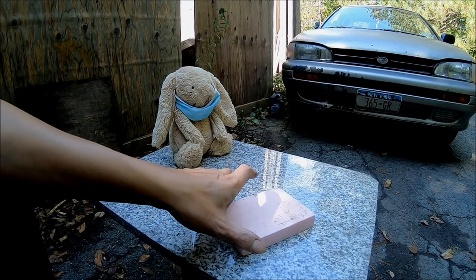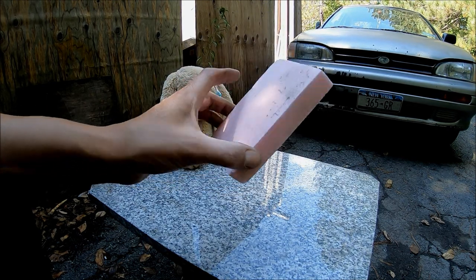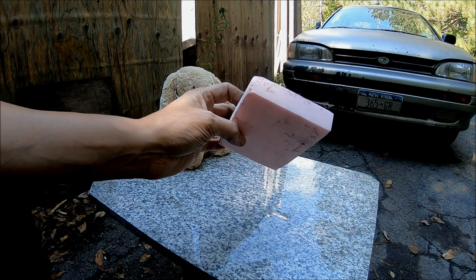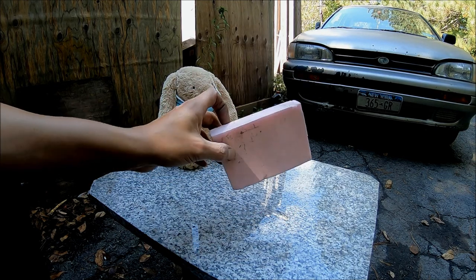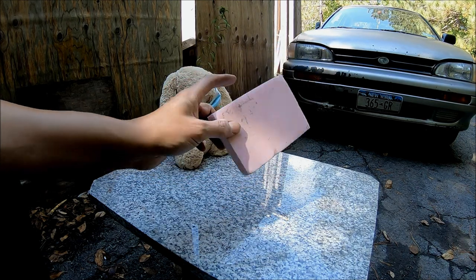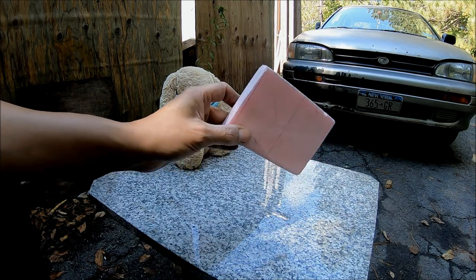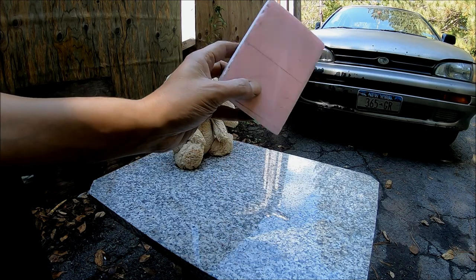And we're back. One of the things I wanted to go over was how to make an aluminum casting using the lost foam method. You see here, this pink foam is just from somebody's house that came off either during the last hurricane or, I don't know, I might have found it along the road somewhere. But this is a quick and dirty way of making a casting. Any shape that you can make out of foam can be rendered in aluminum, as long as you don't have too many bores or holes.